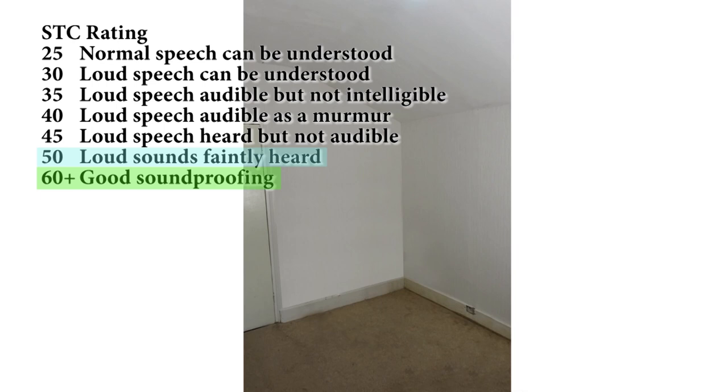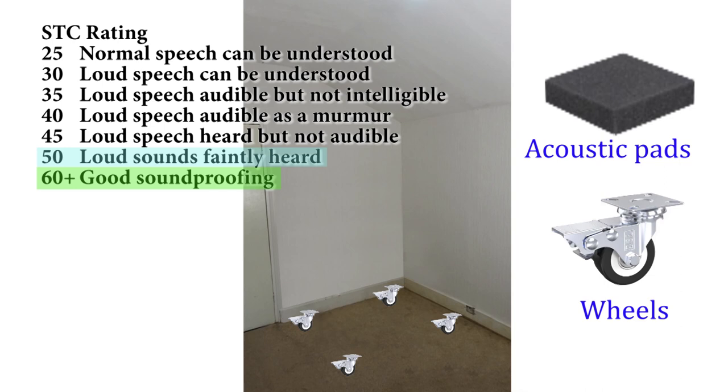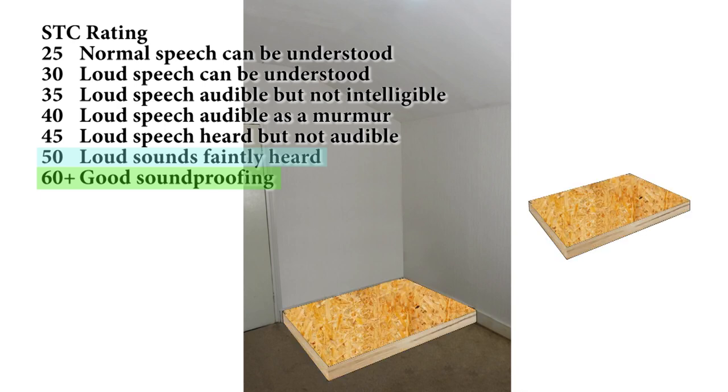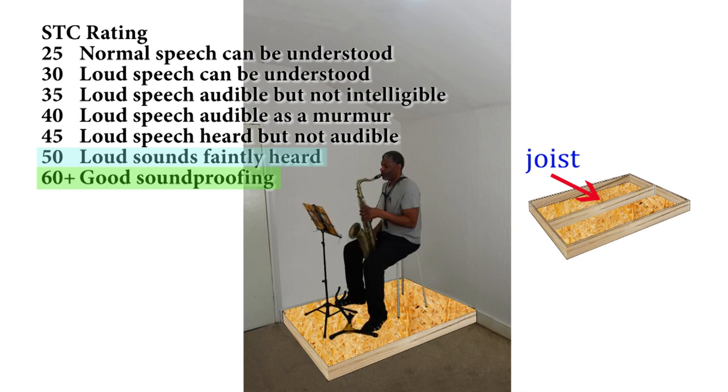You might want to start with the base. You need to consider whether you want to put the base on pads or wheels so that it's movable. My booth will be heavy and situated on carpet, which might mean it's still difficult to move even with wheels, so I'm going to put it on pads. Here I have a wooden base, a wooden framework filled with insulation, and a wooden top. Eventually it will be covered with carpet or a soundproofing rubber mat. You'll probably need more joists or supports in the base to make it more secure, but remember sound will travel through the joists or studs so try to keep these to a minimum. Wood is not the best material for soundproofing but it's strong and the base needs to support my weight. You might need to line the base with extra materials depending on how soundproof you want the booth to be.